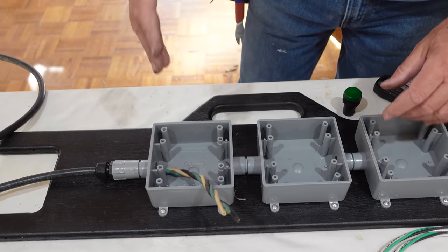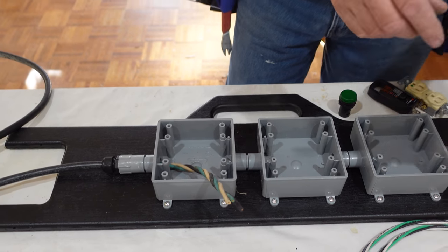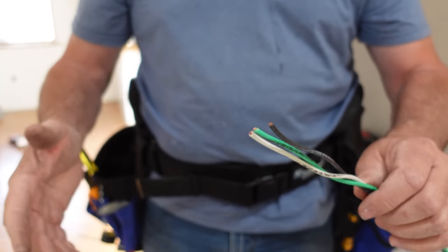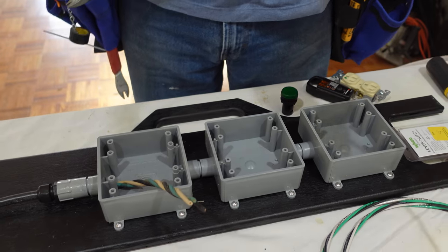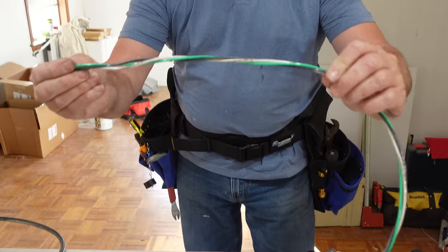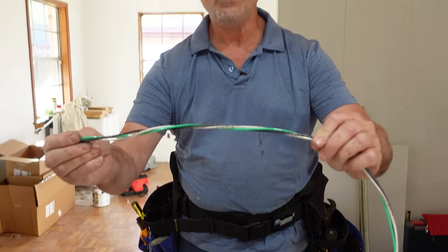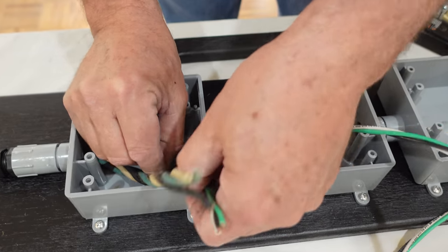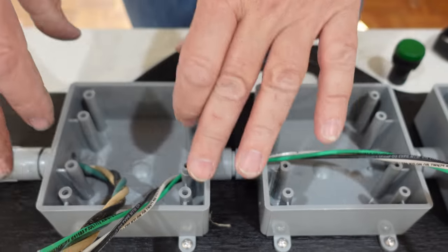First, we've got to run wire to our second box. We had several comments that any wire in a device like this that's movable should be stranded — so point taken. We're going to use number 12 stranded wire. It comes twisted together already at Home Depot — 95 cents a foot, I bought eight feet, plenty of wire. I'm going to feed it through, and now we are ready to put our first two devices in this box.